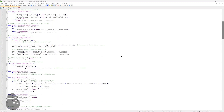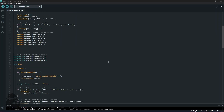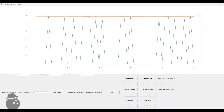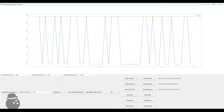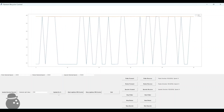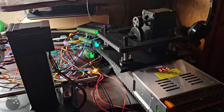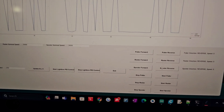The first is a Python script that generates a graphical user interface allowing me to click buttons that send serial communications to the second, an Arduino program, which receives those signals and triggers the movements of the stepper motors. The GUI has dedicated buttons for each stage with direction and speed control and also outputs the light values read by the box. Logic is also in place to scale the speeds of each stepper by the changes in the light values once the PID controller is turned on. The code does nothing without wiring the components, so – cabling rat's nest.